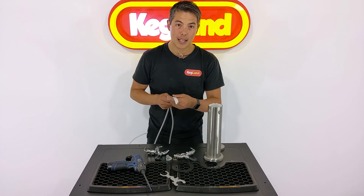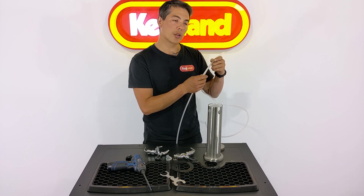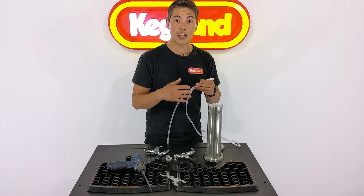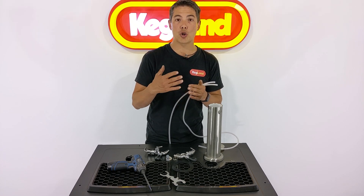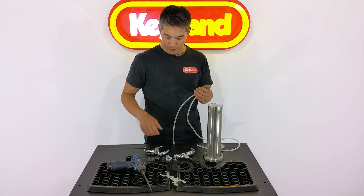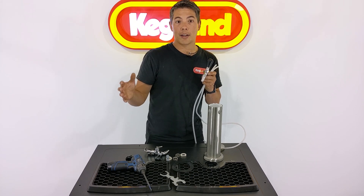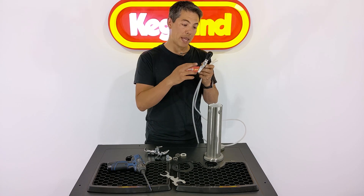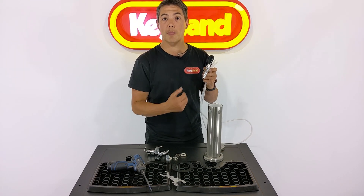In the kit you'll notice you get a bunch of lines — gas line and beer line. To tell them apart, the beer line we always use is the 4mm ID in the kits. Historically we used 5mm ID, but the reason I've gone to a smaller ID is so I can use a shorter length of beer line. When setting up a keg system, the beer line doesn't just get beer from the keg to the tap — it also applies a certain amount of flow resistance. With the tap sitting on the kegerator, kegs like to sit at around 10–12 PSI. If the beer line is too short or too large in diameter, the beer comes out of the tap too fast — like 400–500mls per 10 seconds — squirting out everywhere, causing a lot of foam.